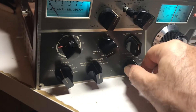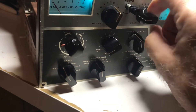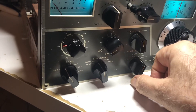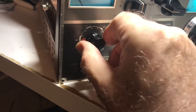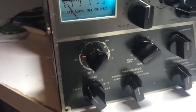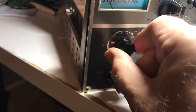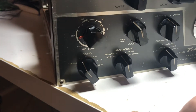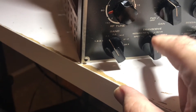As I recall, we got a tune mode here. This is scary. Take our load down — there's our plate. We're on 80 meters. Go to tune mode. Okay, nothing. Take our drive up. Which one's drive here? Drive — here it is. That's gain right there, I think. Do we have any transmitter on 80? Nope, we don't. We're on tune. Crystals are correct. We're on 80, we're on separate. This is gain here. I have nothing.